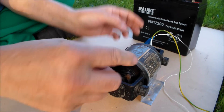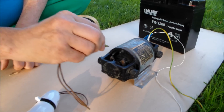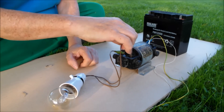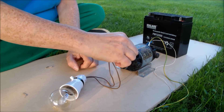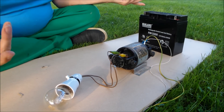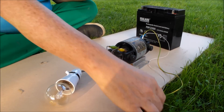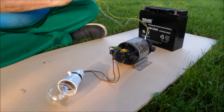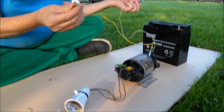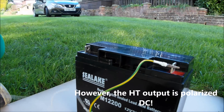So this would spin. Anyway, we're going to boot it up and see it work. This would normally be wired in so you could actually use this device to get a battery valve 100-watt amplifier, because this motor generator — aka rotary transformer — will actually deliver 100 watts. The important point to remember is that these devices aren't polarised, so they'll work either way round. We connect that one there to the LT, and there we go.